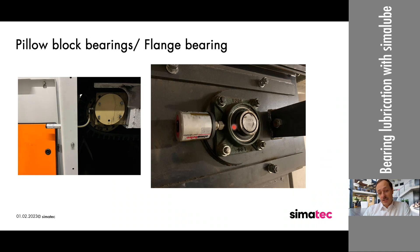Here is another example. As Mark just mentioned, whenever you encounter an M6 hole on the bearing itself, with our reduction it might go too deep into the bearing. Please keep in mind to use a small washer in this area to keep distance and to keep the connection out of the bearing so that we do not break it before it has ever run for the first time.